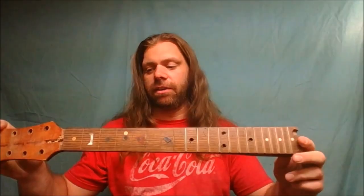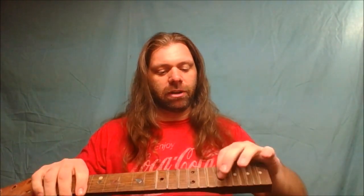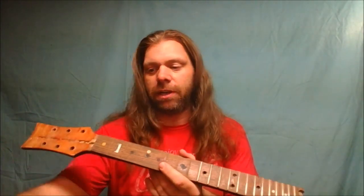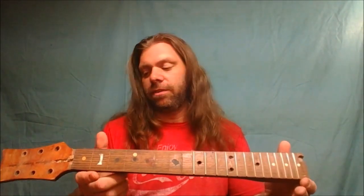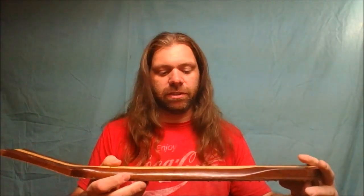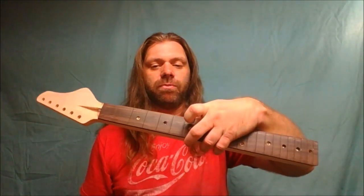So what I'm going to do instead is use this neck here — one I built about 10 years ago, basically a junk neck. I've done some inlays on it and drilled out a couple holes. I'm going to fill those with the orange clay and throw it in the oven for half an hour at 275, and see if the fretboard starts to peel off or if any of the glue joints come apart. That way, if it does fail, I'm not ruining one of my good necks.